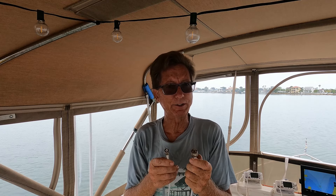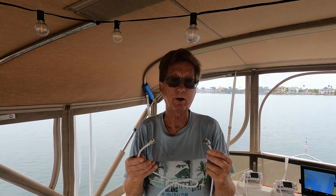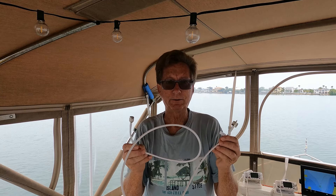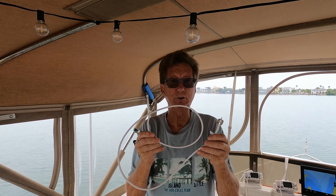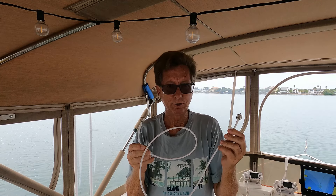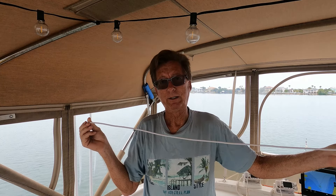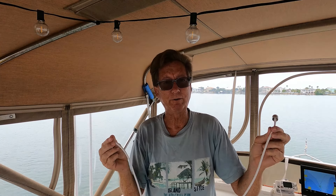Remember you've got to have a VHF antenna — you use the antenna off of one of your VHF radios and still have VHF radio. This cable goes from the AIS to the VHF radio, so you're gonna have to mount it within three feet of your radio.